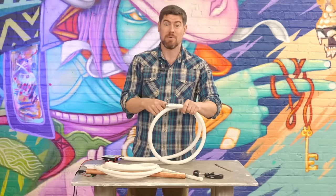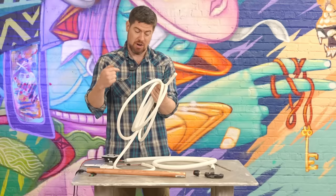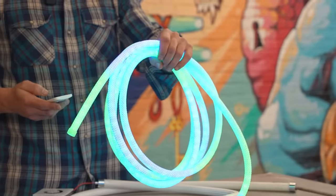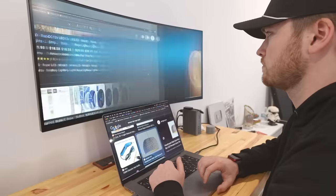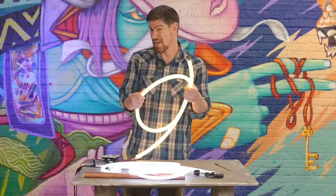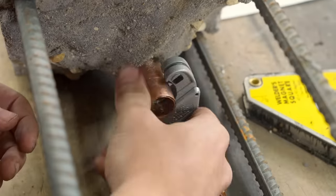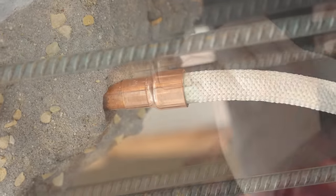Now let's talk about how we're going to connect the LED rope to the fixture. The copper pipe I embedded in the concrete was three-quarter inch, because originally all I'd found was this three-quarter inch RGB rope. RGB is great and looks cool, but it isn't practical as a chandelier over a dining room table — the white light honestly doesn't look that good, it's a really blue cafeteria-light-looking thing. But a couple days after pouring the concrete, Cameraman Cam found some warm white LED rope online. Unfortunately the warm white rope was one inch in diameter, but no problem — I cut a little piece of one-inch copper pipe and super glued it to the end of the rope, then cut back the three-quarter inch pipe and added a three-quarter to one-inch copper adapter so the one-inch rope pressure-fits right in. This is great because it lets me take the rope out if I ever want to change the looping profile or try a different shape.